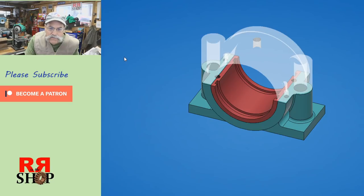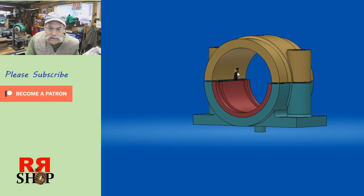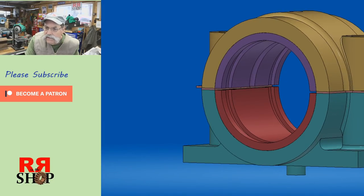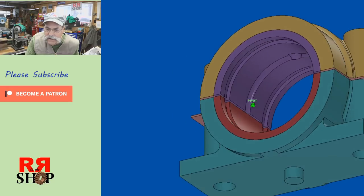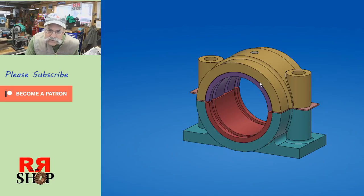Okay, then we'll have, of course, the top shell here, the bearing block half, and it'll be the same with the split pins and the top bearing in there. And those shims are in there, so that's what it's going to look like really once it's all done. I'll be using a bearing bronze for these shells. It's a cored tube actually, so it's like a really thick pipe, right? And we'll machine inside, outside, and these grooves.